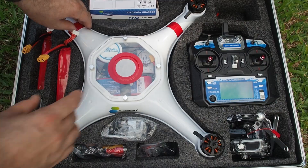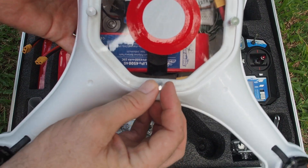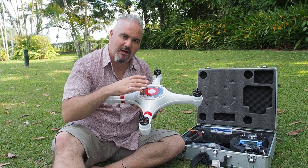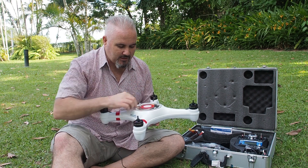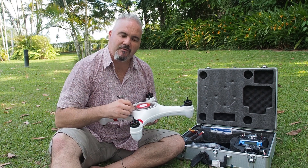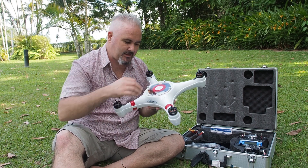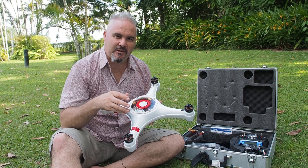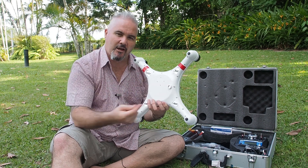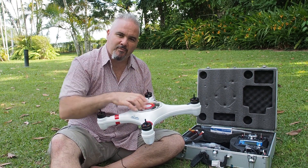Here's the drone itself. Access is gained from the top — you unscrew this perspex lid which has a little cover for air breathing inside. When you take this off it's no longer waterproof, but once it's on, it becomes splash-proof. Another video recommended putting little o-rings inside the screws to make it completely watertight, as water was getting in. This lid also gives access to the batteries and other fittings needed when you attach the gimbal and GoPro camera underneath.